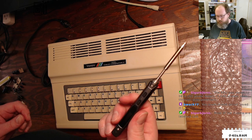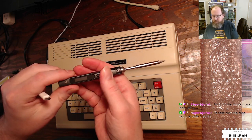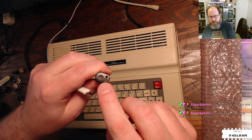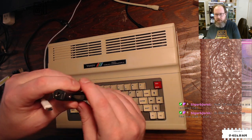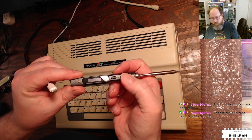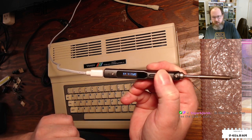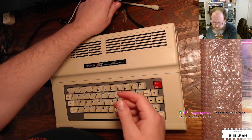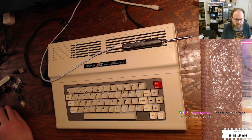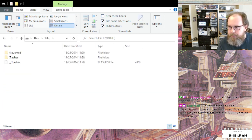But there was a new firmware come out, so we're going to upgrade the software on our soldering iron before we get started. This is the TS100 that has just a DC barrel jack, which is fine for me, because you can supply it anything from 12 to 24 volts. I have a 24-volt supply. So if you hold down the button closest to the tip and then plug in the iron, it pops up there and says DFU. So with that running, let me find it. Yeah, it shows up as a little tiny storage device.